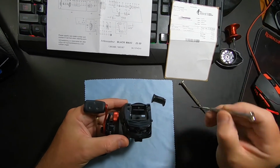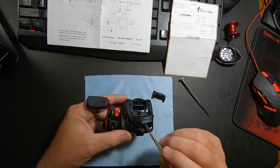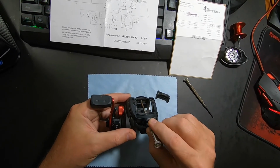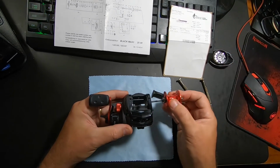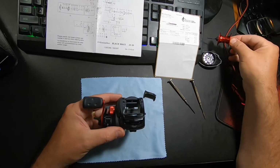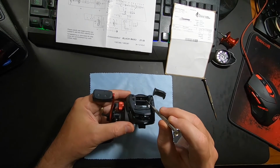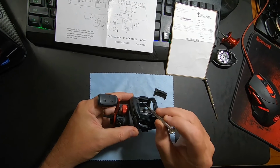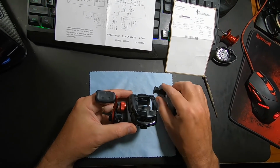And if you look down in there, there's one screw that holds that piece in place. You can go in through this gap here to get your screwdriver on it, or over the top. You can't do it when the spool's in because it doesn't give you enough clearance. Be careful, or you'll strip the screw out. I actually had a lot of luck with it. It's a Phillips screw, but it's a universal. And I actually used a flathead screwdriver to back that thing out, 4 or 5 turns,